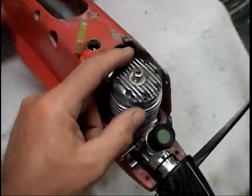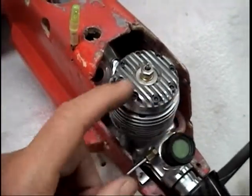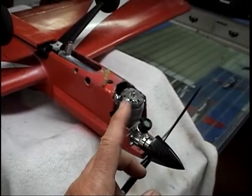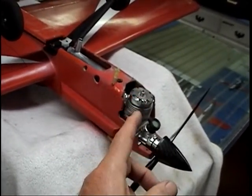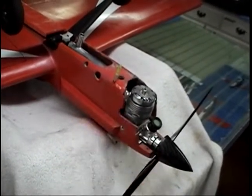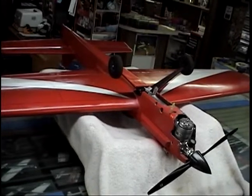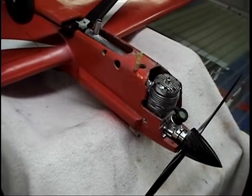If we couldn't have gotten rid of that weight, and now that we have a spare one, a lot of times, and one of the things Rich and I have been talking about is if he can get me a spare case, and I can kind of grind away on it and get rid of some of the weight. And it's really just for this plane, but there's an even better solution. They have a cast case, and we don't know yet. He's going to talk to Dub if these parts fit. We can just replace the case with a cast case, and I think that's a little over an ounce lighter. And boy, would that make a dramatic difference to the plane. That'd bring the plane in under 70 ounces. Given all that stuff, we would have an under 70 ounce.